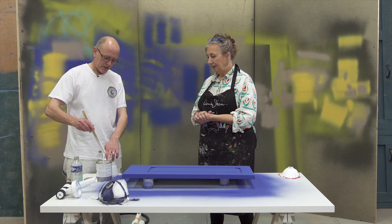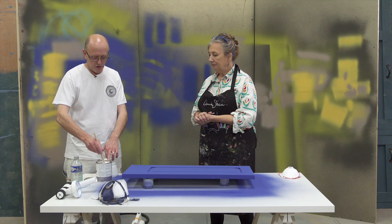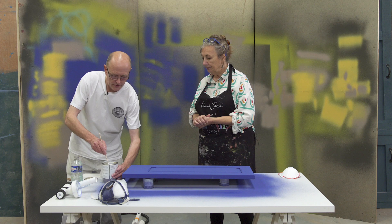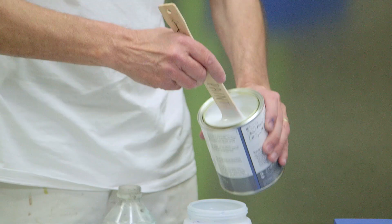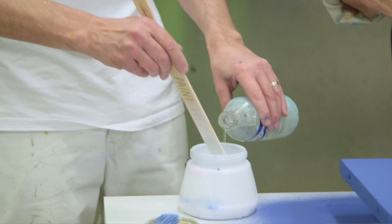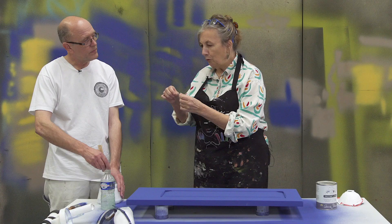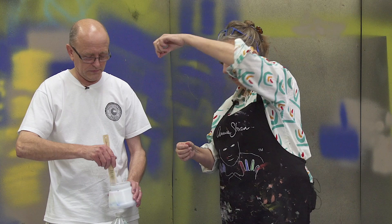The lacquer, along with the paint, we're going to have to thin to get it to spray well. We can see that it's much too thick. I don't think we're going to need it thinned as much as chalk paint, but we're definitely going to need it thinning. So if we put some lacquer in the pot, we're going to add initially about 10% water in. Of course this is a water-based lacquer, and that's why Ron is now adding some water to it. Before Ron started, he gave this lacquer a really good stir because all the goodies are at the bottom. Last time you talked about worm casts, which I think is a great way to describe it.